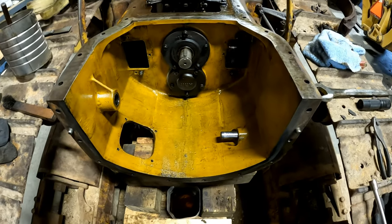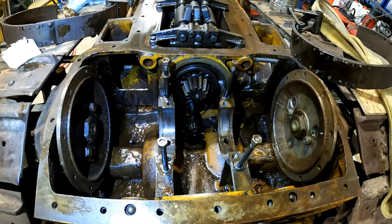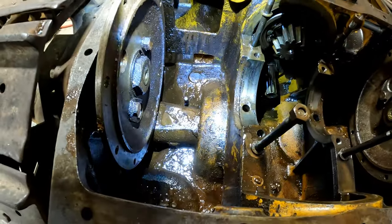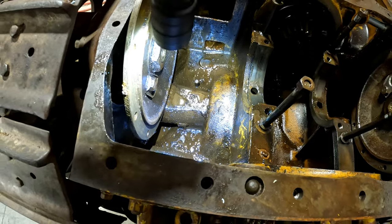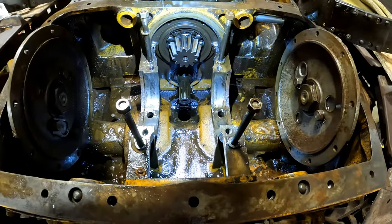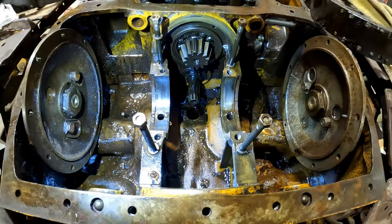There's an after. Now I've got a little bit more work to do. Been cleaning this up, spraying it down with solvent, diesel, but looking a lot better. Still working on this compartment. A lot of you might have seen the short video that I filmed where I was dumping water, and rest assured I was just dumping it in this side over here, which was already full of water right up to where that axle housing is for the final drive, and kind of trying to flush this out. And then what I do is spray it down with a little bit of diesel so that it'll help get some of that gunk to move and get it down. I got some pans under there to collect it, but still a lot of work to do inside of here.